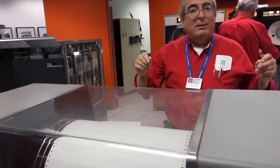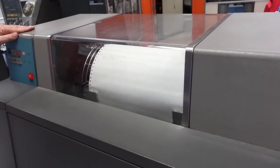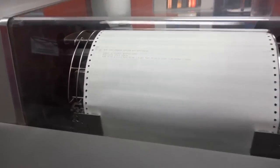It was the sparking. So what happened is that we just wrote a whole bunch of stuff on the tape, and it tells us that it didn't get an error. So the brush arcing was causing the error, and now they're good brushes, and now we're good to go.